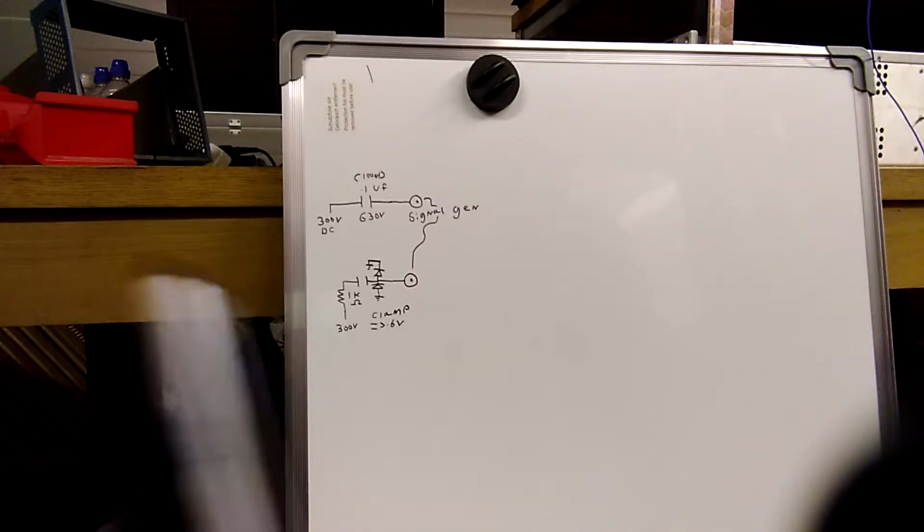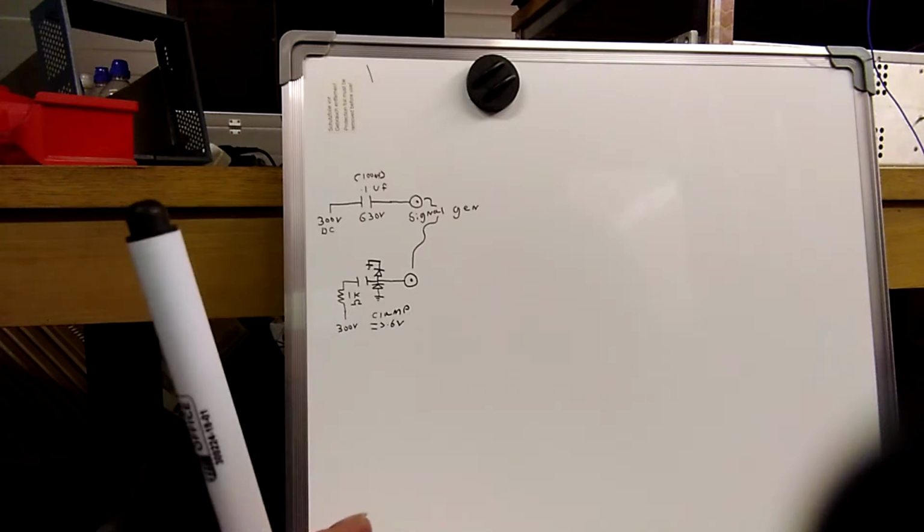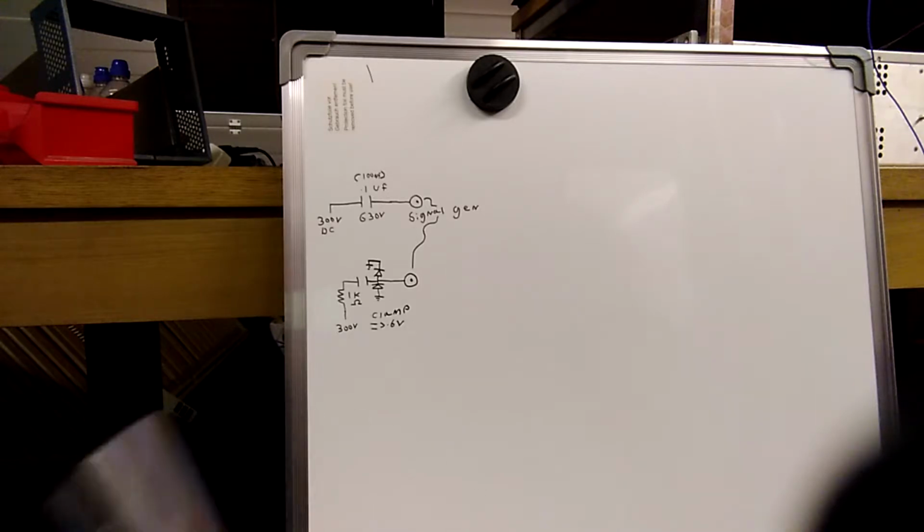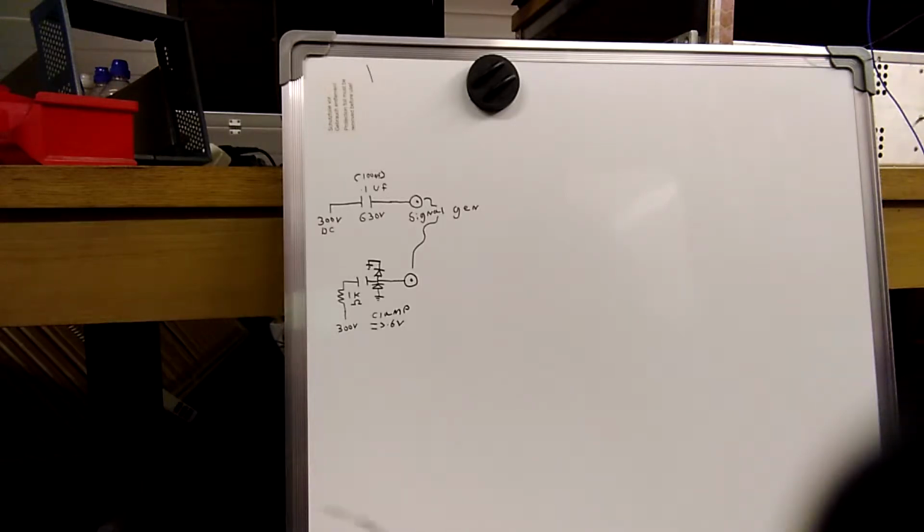So in old radios, one of the very, very common things for aligning it, and pretty much all of them that I know of, is of course injecting a signal directly into the IF, right? The IF tube, bypassing the tuning and such. This is so you can line it to get the maximum amplitude, or signal out, I guess, if you like.